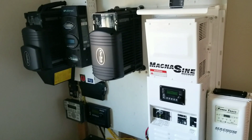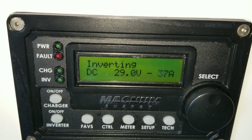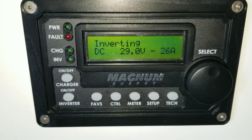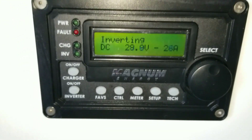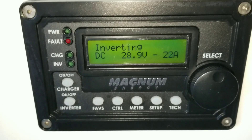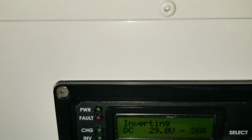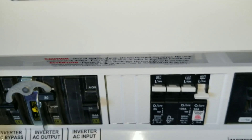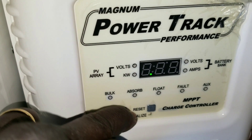I've been working all day putting the system together and getting everything cleaned up. Right now I'm doing laundry — this is how laundry affects the system; you can see the amps being drawn anytime it's spinning. We've been sitting for about five days with these batteries with no charge. I turned the solar off and the breaker off for the solar, so the charge controller is still sitting there but no power is coming in.